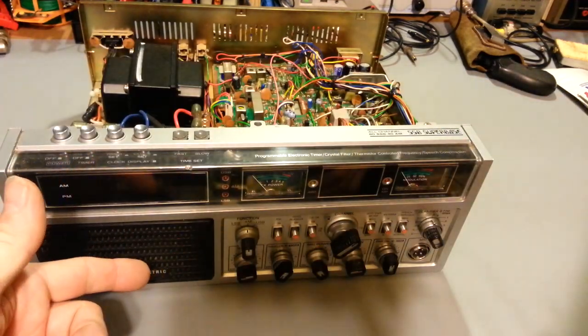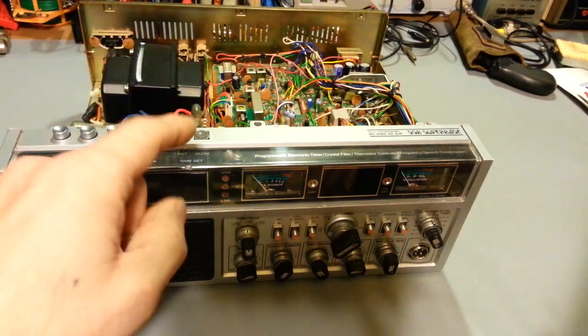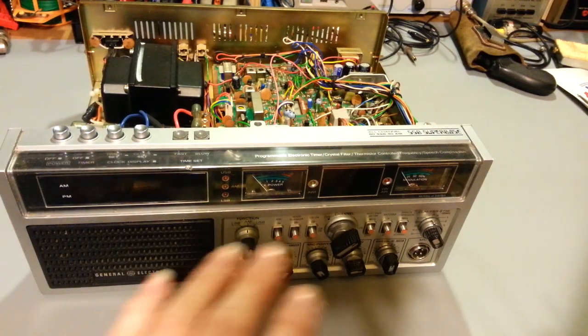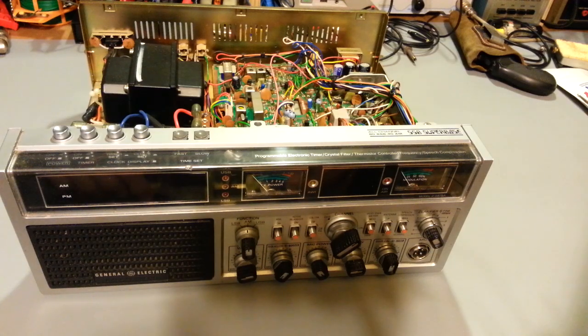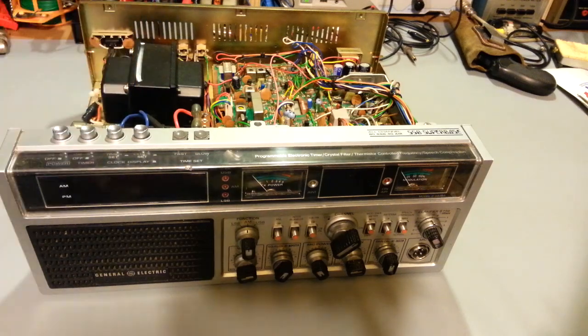The bottom cover has to be replaced — it's bent pretty bad. It'll be simpler just to pop in one that's not bent. The feet are broken off, but the other plates already have feet on them. Same thing with the top cover — it's tweaked and bent, and I have covers in better condition. Basically all this radio needed at one point was a cap job, transceiver alignment, and definitely repair those traces. Because that's going to progressively get worse — even if you change the cap, those corroded traces will just continue to corrode to the end of time.